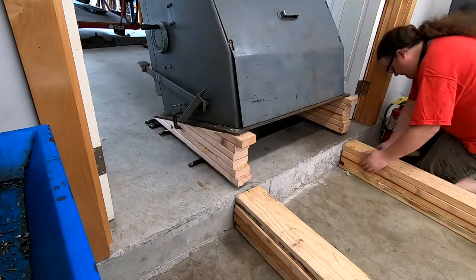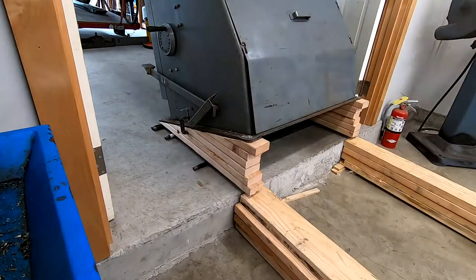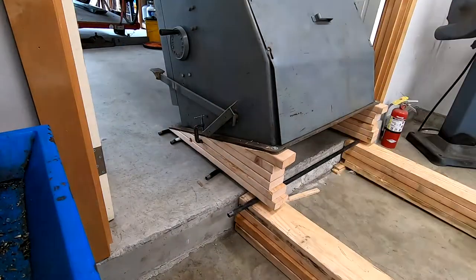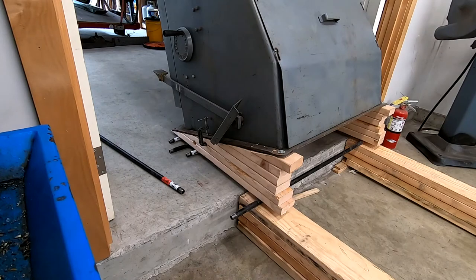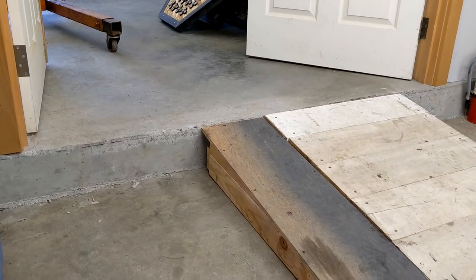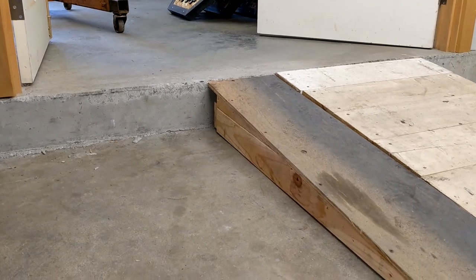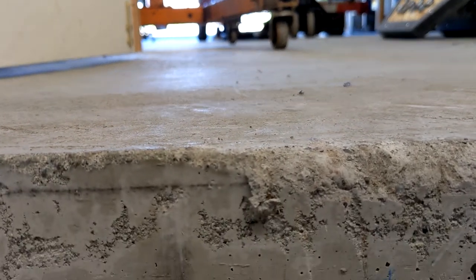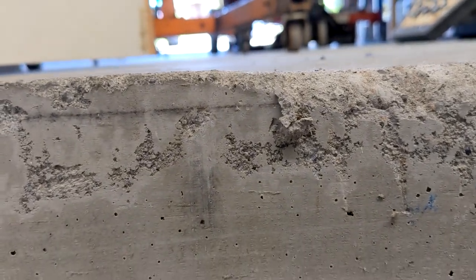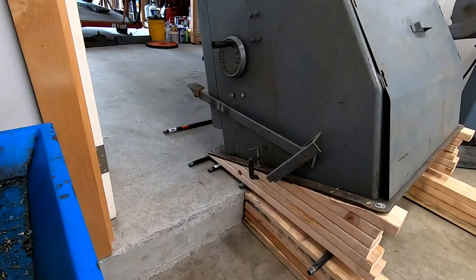Everything went well at first. It got up to the transition to the wood blocking and then rolled partially on it just fine. Unfortunately, this was the point that I realized it was getting less and less stable. Suddenly, there was little to no weight on the front of the saw at all, and it was all precariously balanced on the rollers at the back end. There were a couple very hairy moments indeed here, where I had to carefully back it up, while not letting it tip, while being very careful never to stand in what I could only think of as the squish zone. My mistake, as far as I can figure out, was something no one with my amount of metrology training should ever have done — I assumed surfaces were parallel just because they looked like they were. They're so easy to draw that way. But concrete floors are just goopy mud that has been cleverly frozen into place, and very little about it is actually planar unless someone has put a hell of a lot of effort into making it so. Not surprisingly, that effort does not seem to have been made when my shop floor was poured. There is a bit of a lip as the floor approaches the step into the inner shop it turns out — not much, but enough to invalidate all my careful balance tests.